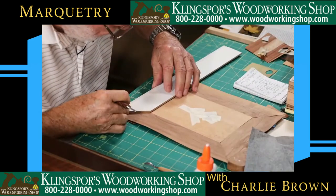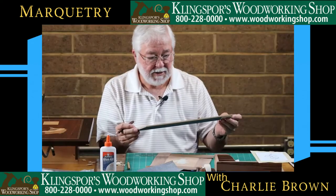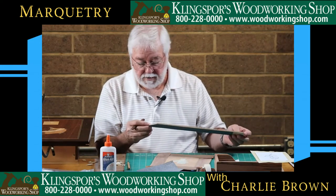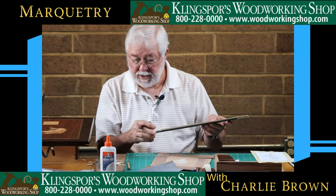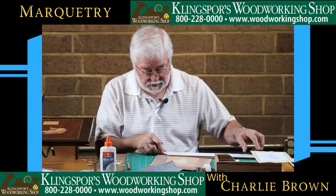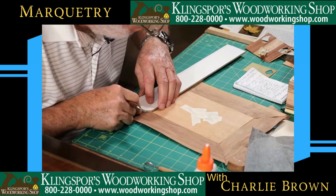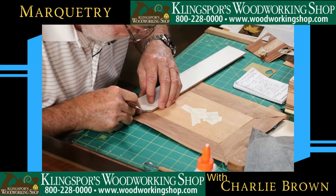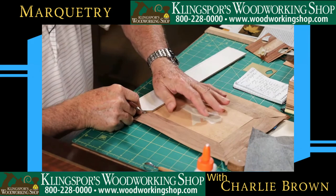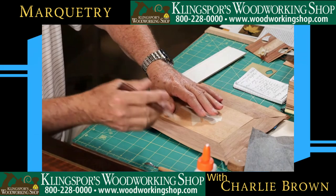Okay, so it's important that you square your device up, and the device that you're going to use here is basically anything that's a pretty durable material. In this case, it's some sort of trim work MDF. Make sure that you cut it on a true 45. And in this case, I put a little bit of adhesive backed sandpaper on there so it doesn't slide around. So I'm going to line this corner up with the corner of my picture, making sure that it is parallel to the cut picture. And I'm happy there. I've got a non-slip surface on the back. So I'm just going to cut through this piece of veneer and this piece of veneer, and then what I'm left with is the finished product.